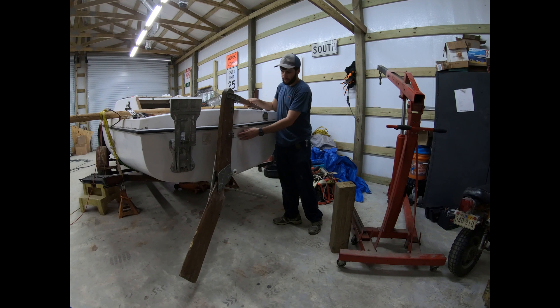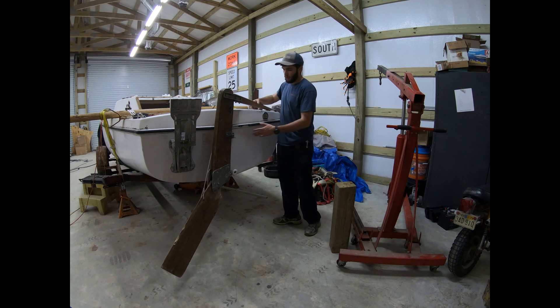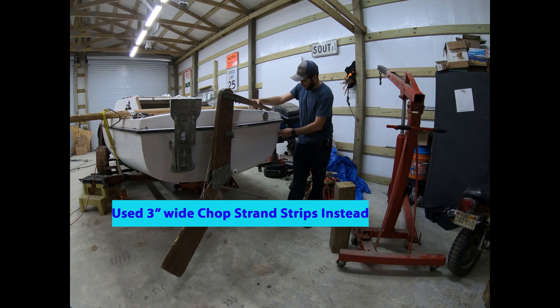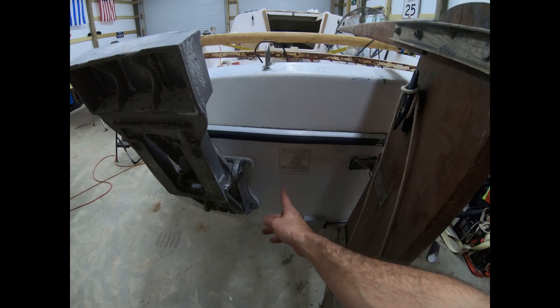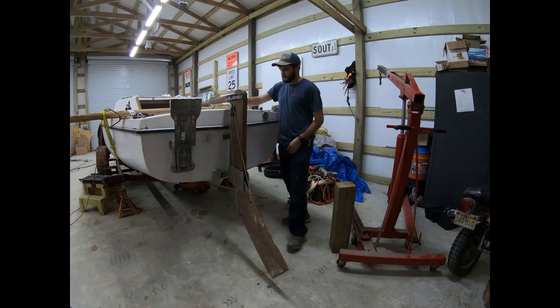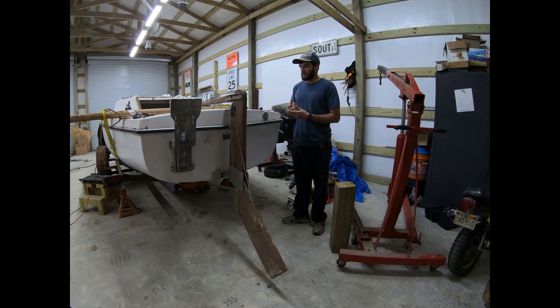What we're going to do is on the inside lay some PVA down — polyvinyl alcohol — which is just a separating agent used for fiberglass molds. We'll put tape on either side of the PVA and then using epoxy with some thickening agent, lay up a one-inch strip going from about here all the way to the motor bracket, which comes about six inches on either side. We'll make a template, and once that sets up and cures we'll take it out of the boat and on the bench fabricate the actual stiffener — basically a piece of angle, but it needs to follow the curvature of the transom. Rather than reworking existing angle stock, I'd rather just fabricate one that's more fit for purpose.